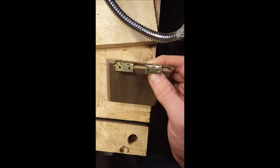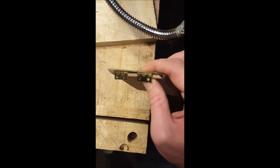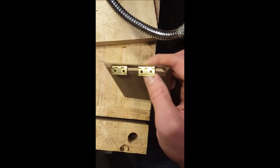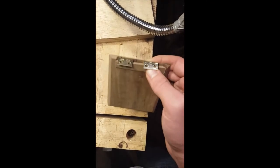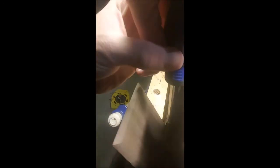When I apply this little shim, I can put a screw down through the thicker part — that will have some integrity — and then glue it down. It's essentially a four-piece groove to fix my stupidity, which is what I should have done to begin with. Now placing the hinges and lid on the box: one technique is to back the screw in a little, put it in, then back it out — so it doesn't split the wood. Then I just used a card scraper to flatten it out.